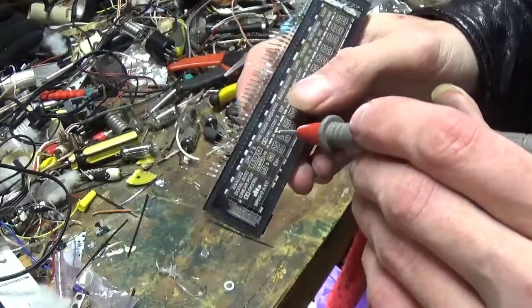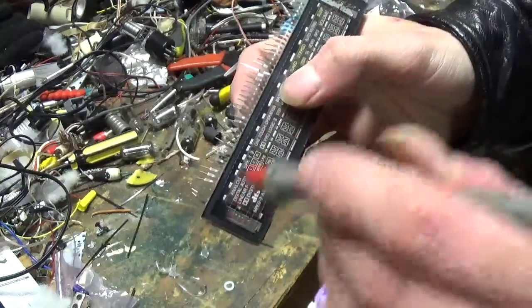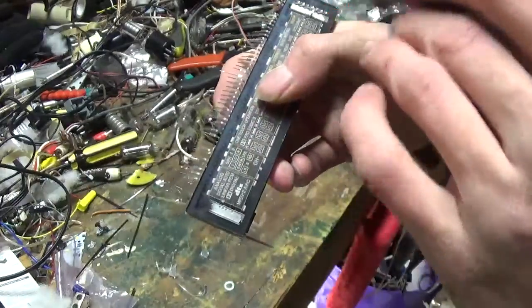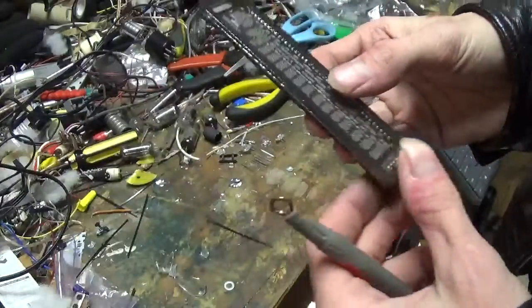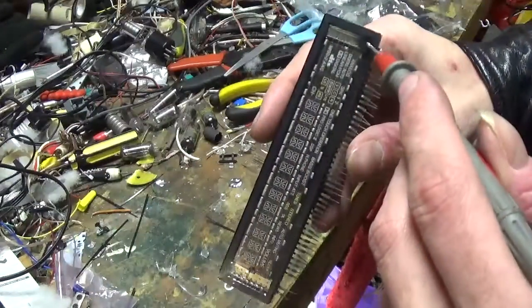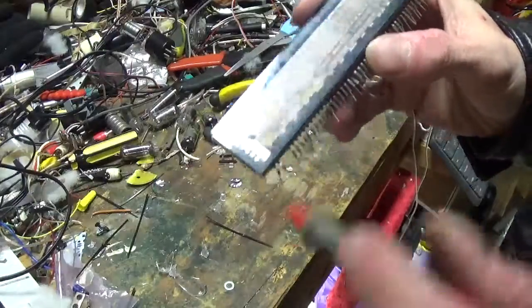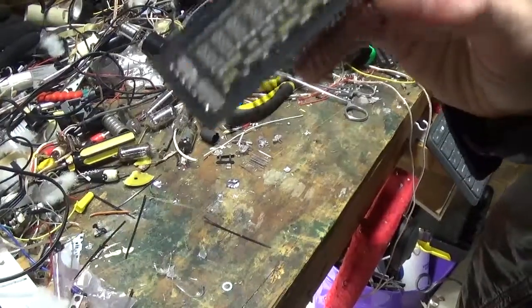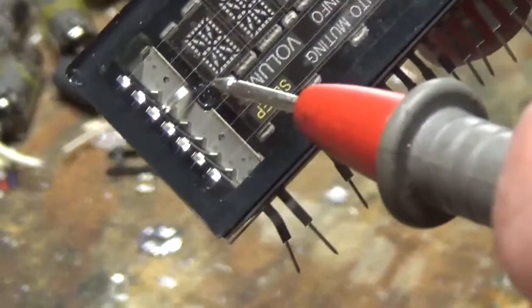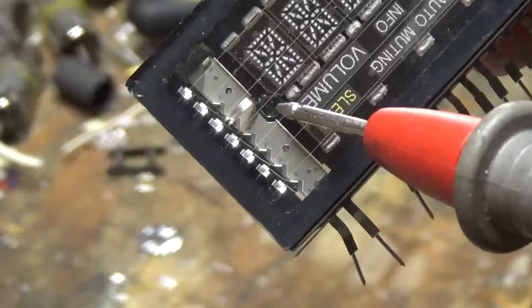And in some vacuum fluorescent displays, there's two getters, one on either side. Some have one, some have two. It all depends on the make, model, and design of the screen. In this one's case, it's one. One side, I guess that was enough. See, if you look close enough there, you can see a little pit. And that's where that little nub was on the opposite side that they melted down. That's where it's sealed at.